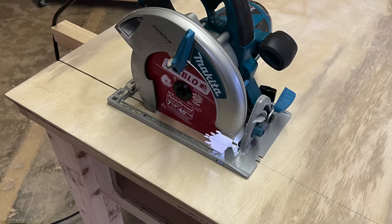This phenomenon is at the heart of freehand cutting, because when you learn to line up early and start on the right track, it becomes immeasurably easier to stay on the right track. In fact, when I'm about a foot in, I'll often take my free hand off the pommel and place it on the board to make sure it doesn't move — because board movement is very dangerous. With my blade on track, I can just watch it closely from behind and above and make those tiny micro-corrections required to prevent it from going off track.